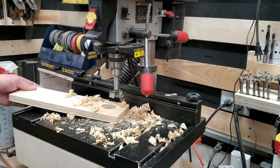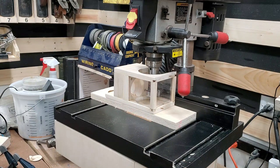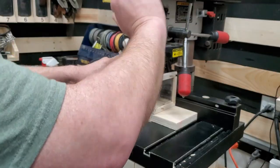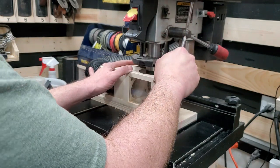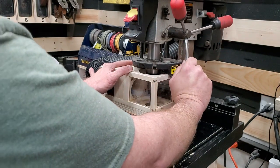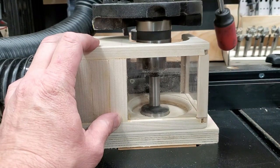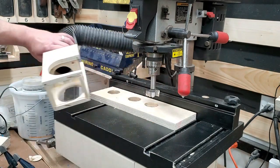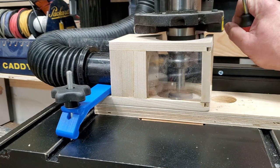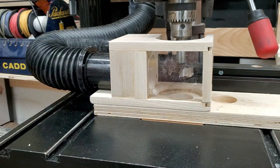Let's look at our before and after on dust. Here's with no dust collection whatsoever. Here's with just a hose in place — that only captures about a third. And now look at this with the dust shield. With the dust shield in place, glass closed in the rear, I attach the hose and drill normally. Because it's glass, I can see the actual bit — I can see exactly how I'm drilling, I'm not getting chips thrown at me, and they're not flying all over my workbench. All those chips are getting sucked right into the dust port. As I zoom in, you can see as I plunge the bit in, it's sucking all that dust and chips right into the vacuum hose. When we're done, there are virtually no chips or dust left — it's extracted nearly everything. The results are repeatable: extracting nearly everything and leaving almost no residue behind.